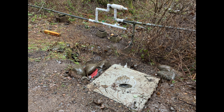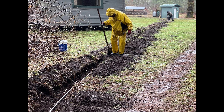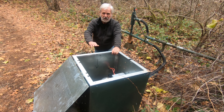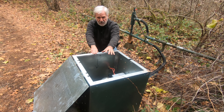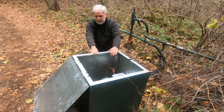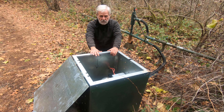The heater is where the controller sends energy when it senses our batteries are charged. Ready to build your own system? The first thing is to pour a cement pad to put your micro unit on. Then you shanghai a couple of good friends on a bitter cold rainy day and get them to trench your electric connection from the pad to the shed where you've got your controller. We finished our installation — we put the micro hydro unit right inside this box and bolted it to the concrete pad. We've connected our wire to the utility shed, hooked it up to our breakers, our charge controller, and the heat dump. Turned the switches on, so we're ready to activate the system.